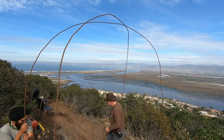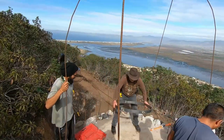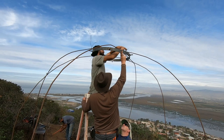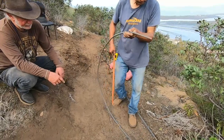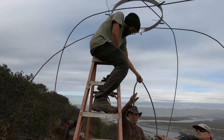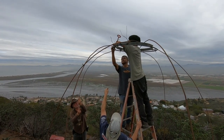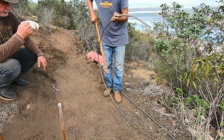We've got this really cool ring for the top — it will be the access door that comes down in the top of the boulder and it'll get wired in up above us. What we're doing now is bending a rebar ring which will be on the outside of our access door and be a place to terminate our verticals coming up from the side. We've hung three temporary pieces of rebar to hold the access roof. Martine, who's been doing this for many years, is using this simple tool made for different size rebar — half inch and three-eighths inch — for bending rebar. It's something you can have out in the middle of nowhere without fancy tools.